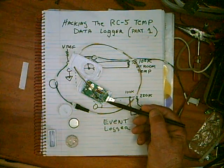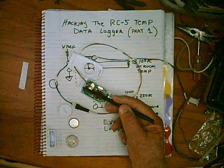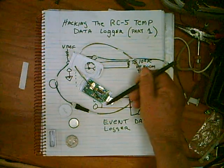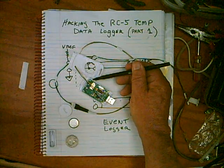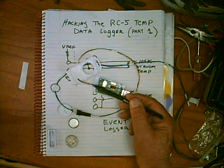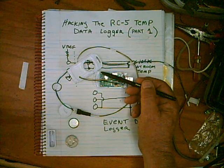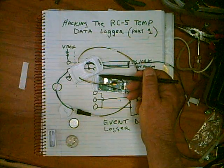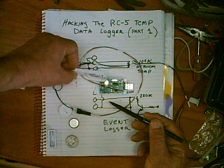It appears the silicone sort of seals this end, and they do something at the other end — maybe a little bit of ultrasonics or just a light amount of glue. But you can crack this open with a knife once you scrape away the silicone, and it'll bend over and stop sort of about at the location where the lanyard is. It appears to be glued there. Go in with a knife really towards the end — don't try just prying it apart or you'll crack the case. I snapped this apart and I'm going to be able to put it back together.